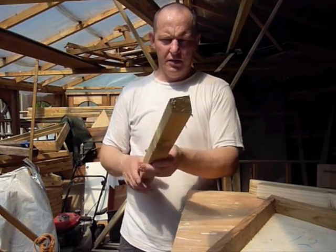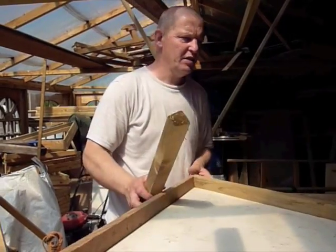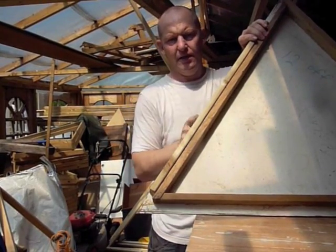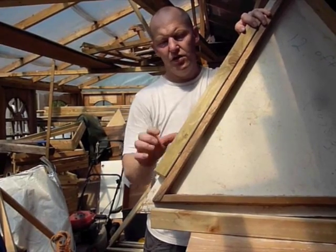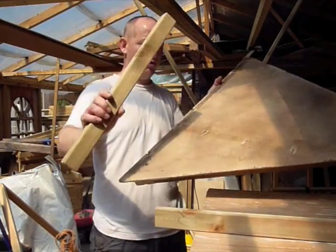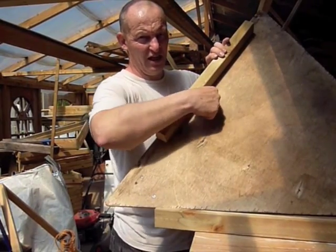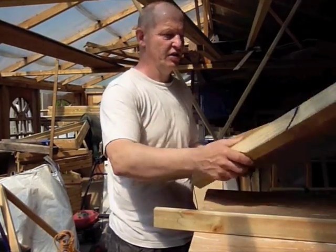So you've got a whole stack of timber cut. This pattern here was made for thin timber — you can see that it fits against the pattern and is flush to the edge. Obviously if we use fatter wood, it comes past the edge, and you'd end up with a bigger dome — you don't want that. So once you've made your struts and triangle templates, put your fat moulding on and you'll see that you just glue your timber against this edge, which makes the jig effectively smaller.